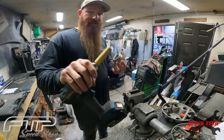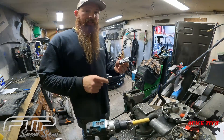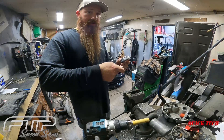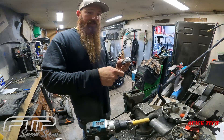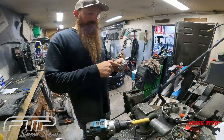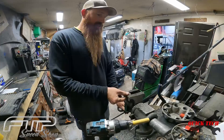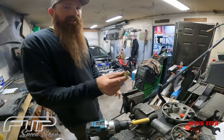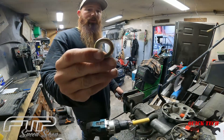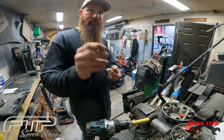If you don't have sticky-back tape, you can use regular sandpaper and just tape it onto the socket — wrap it around a couple times, then wrap the paper over the top of the tape so it grabs. That worked out really well. We just machined a little bit of material out of both surfaces to get a slightly looser clearance so we can get it on and off without fighting it.